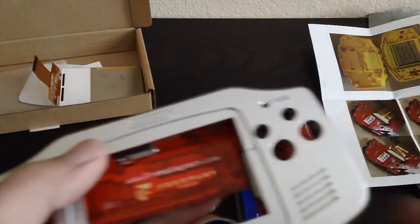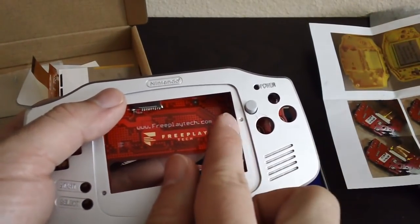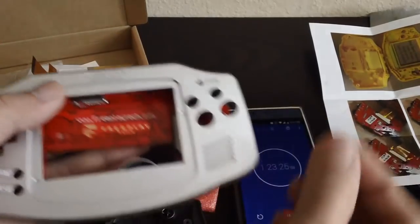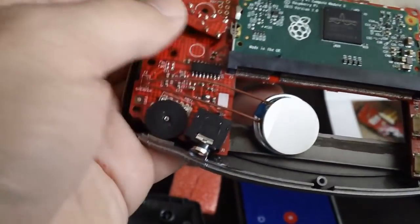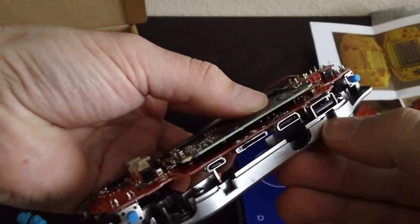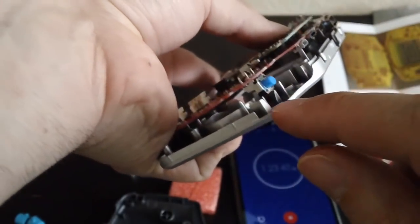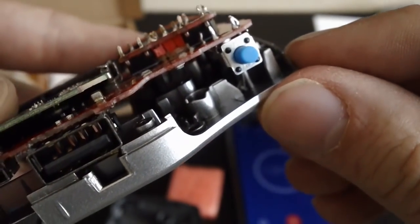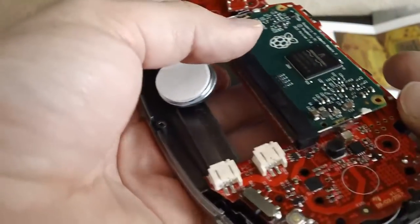Those didn't turn out too badly. They will go ahead and fit the button caps. Here's an example — there's the button cap and it does fit on there. But like I said, it is really close to the screen. I wish they were oriented the other way instead of closer to the screen. From the top, we're definitely going to have to start cutting that plastic. That extension port is going to need a little bit of cutting. That post needs to go away. And the shoulder buttons each have this post right there getting in the way of it ever getting down in there, so the micro switch has to fit inside that little cavity and each side needs that little post to go away.